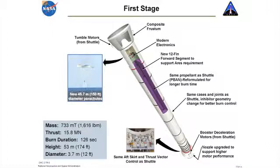It uses the same steel case — I'll emphasize it's the same steel case, not the same design, it's the same near serial numbers. They have a lot of use left in them, and so we actually will be flying the very same steel cases that are flying today on the shuttle. There will just be five of them instead of four. So we're restricted to the 1,016 PSI for the internal maximum expected operating pressure. We'd like to have a little bit more, but that's all we're comfortable with in those cases. It will be recovered.